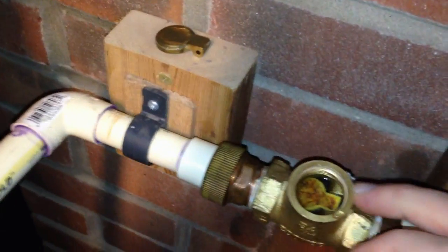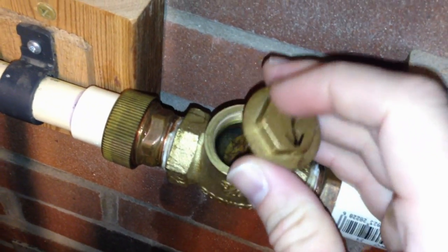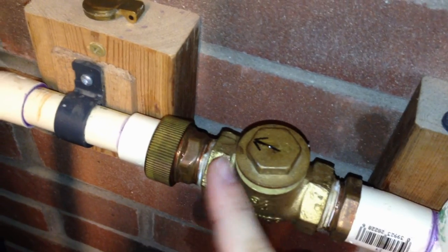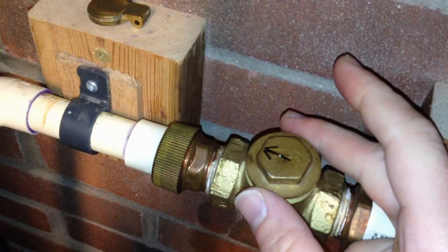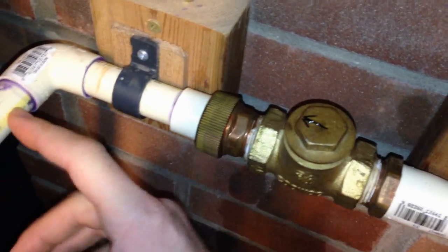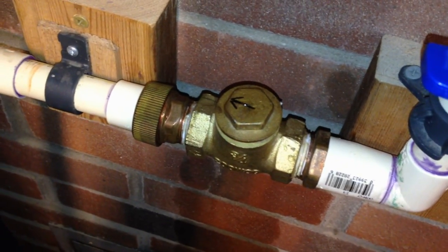Because my faucets aren't producing enough flow to suck this valve down and shut it, this pin is going to push that flap down and keep it down at only a slight angle, so as soon as water wants to flow back this way, it closes and stops. Then once the water pressure equalizes — meaning when you turn your faucet off — the pressure will equalize in your lines, this will open back up, and the hot water can flow back and keep slowly circulating in your lines, so you always have hot water coming out of your spigots immediately.